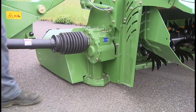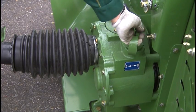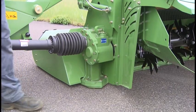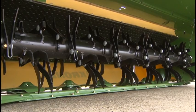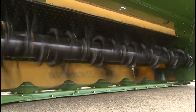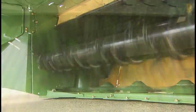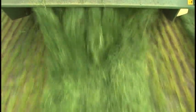The conditioner's speed can vary between 600 RPM and 900 RPM. The 25-inch rotor is tailored to suit long-stemmed forage, such as native grasses, ensuring a smooth crop flow and an optimum intensity of conditioning.